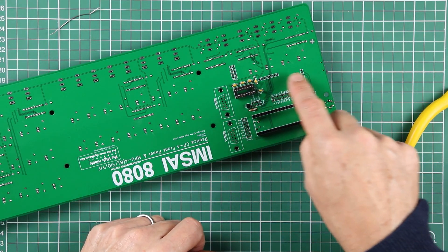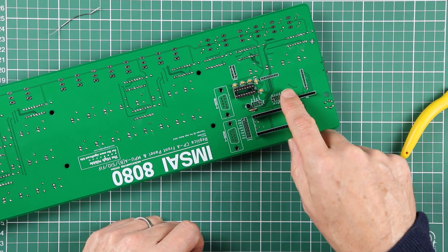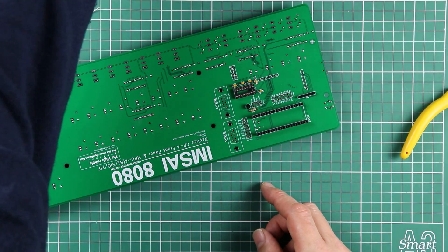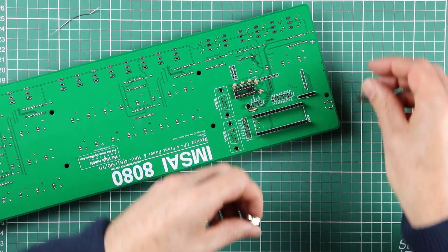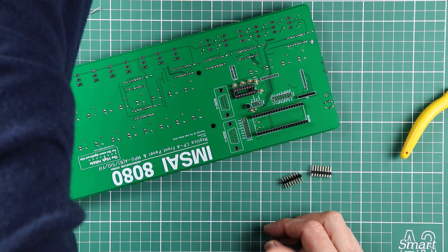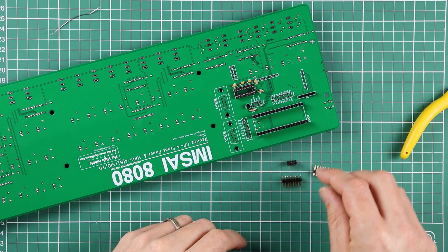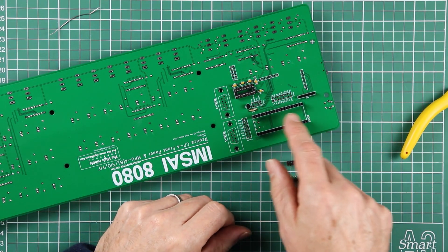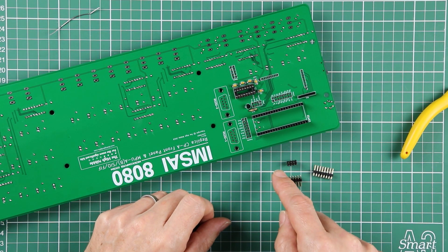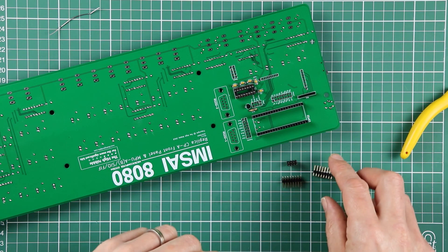So I think that just leaves us with some pin headers used to configure RS232 comms. This pin header here is for some future functionality that I might get around to implementing regarding boot options and resetting back to factory of the ESP32. And then the other final two components we'll put in are the two DE9 RS232 connectors.